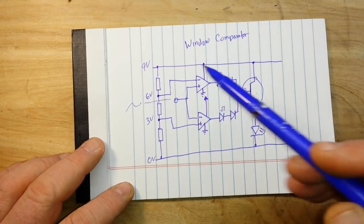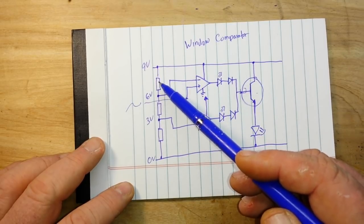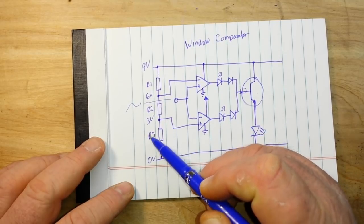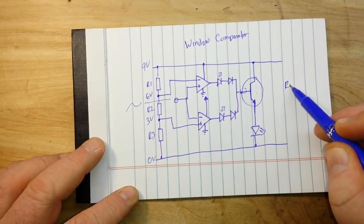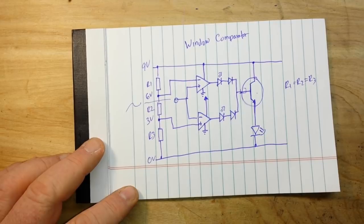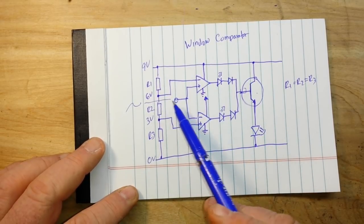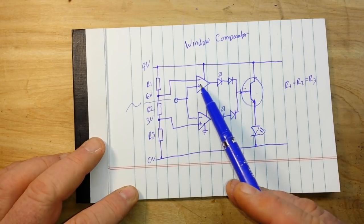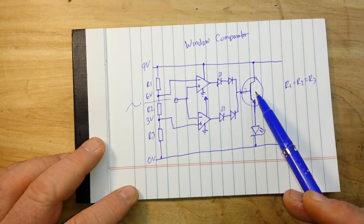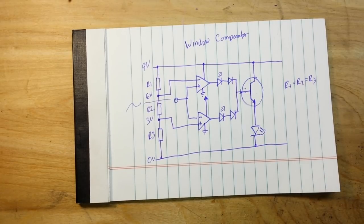You should really have a base resistor here, but for our purposes I'm just going to limit the current through the power supply that we're putting into the circuit. So, again, we'll go over this real quick: we have a 9 volt rail, 0 volt rail. R1, R2, R3 should all be equal — R1 equals R2 equals R3. That will give us two-thirds and one-third power, giving us our high VREF and our low VREF. Signal comes in — as long as it's in between those points, op amps remain off. If it comes outside, the op amps turn on, activating the transistor, which will activate our voltage cutoff. Simple enough?